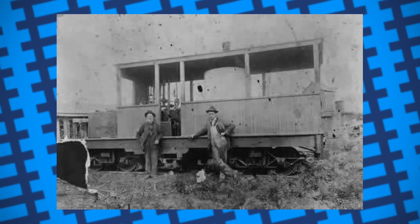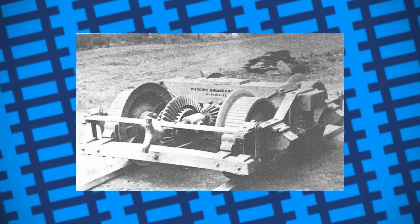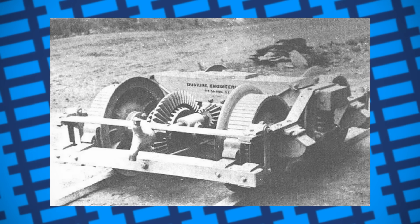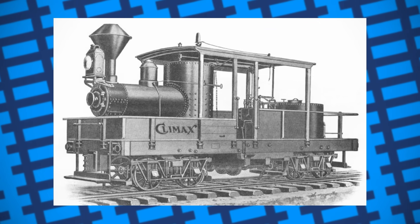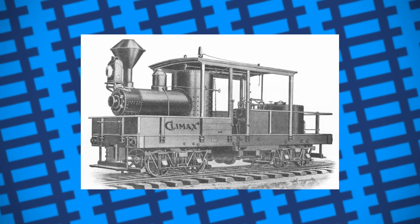The Class A's were easy to modify too. Many were built to different gauges, from 2ft narrow to 9ft broad, and their wheels could be changed accordingly to the rails they'd be running on — smooth standard wheels for regular rails, grooved or cleated wheels for wooden rails, and concave wheels for pole roads. As the years went on, the design was improved: steel frames were used in place of wood, metal cabs replaced wooden boards, and the vertical boilers were swapped for T-shaped and later regular horizontal boilers. Four Class A's were built with an 0-4-0 wheel arrangement for use in Tionesta Valley, but no more were built after they were found to be underpowered. The popularity of the engines led to the Climax Manufacturing Company ceasing production of their other products and rebranding themselves as the Climax Locomotive Works to focus purely on building locomotives.